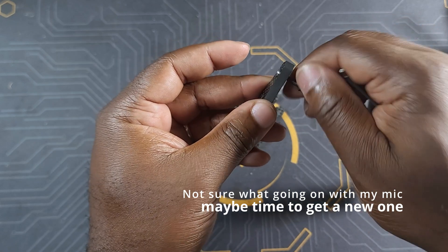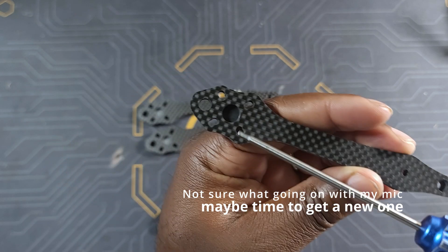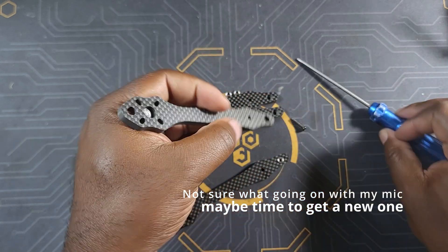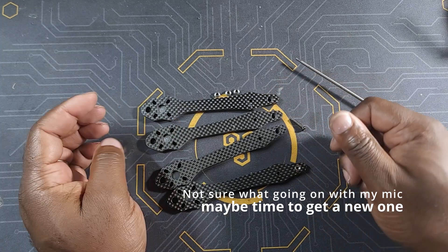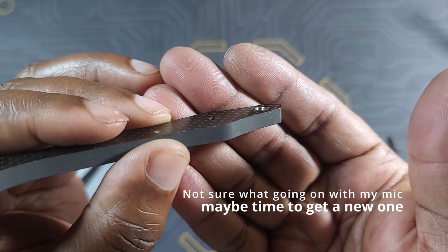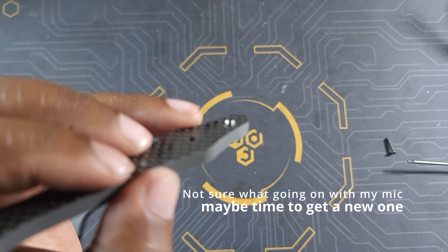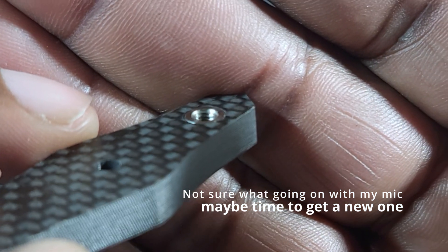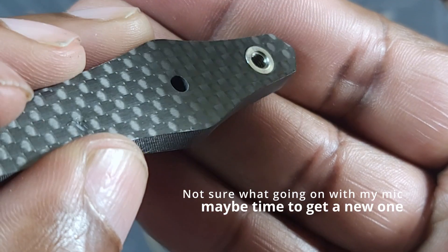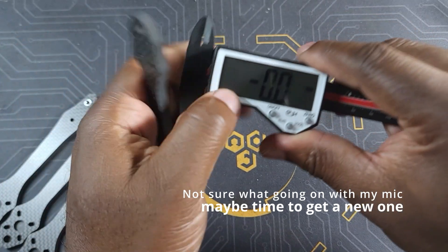You can't really mess this part up because if you look at the arm, the top portion has a small indentation where the press nut goes. On the top portion of the arm there's an indentation for your motor screw, while the bottom portion is completely flat. Make sure the press nuts are completely flush — actually slightly deeper than the rest of the arm — so you know they're well seated. The arm thickness, if I'm not wrong, should be about 5mm — we got 5.5mm.